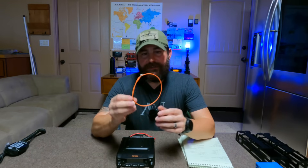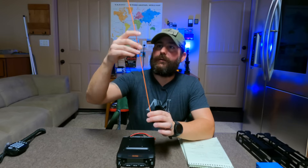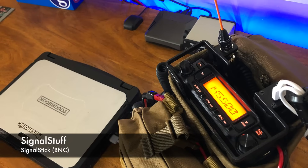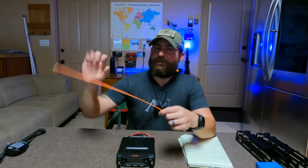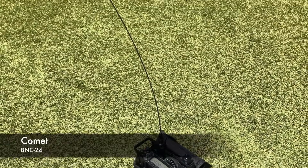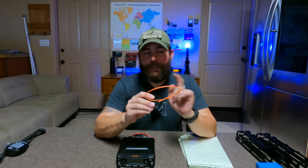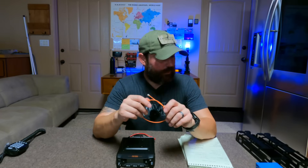The other key component is the antenna. I actually find whip antennas to be quite nice. This is the Signal Stick by Signal Stuff — it's pretty heavy duty, though mine has a little bend from being stored in the bag. I also have the Comet BNC24. The wonderful thing about both antennas is they can run higher power — the Signal Stick can do up to 100 watts, though you have to be careful with RF exposure, and the Comet BNC will do up to 20 watts.